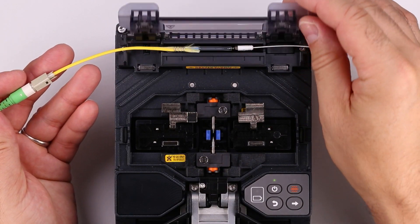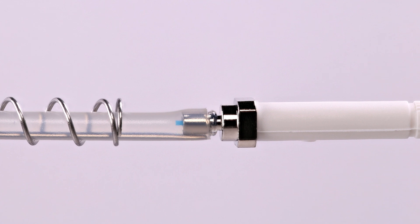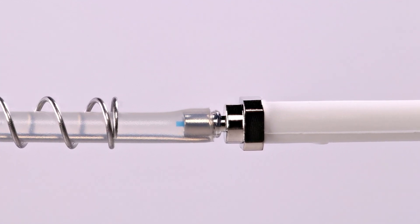Open the heater lid and remove the assembly. Inspect the placement of the protective sleeve on the hub to verify the sleeve uniformly covers the smaller diameter of the hub.